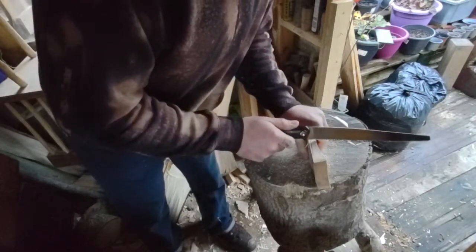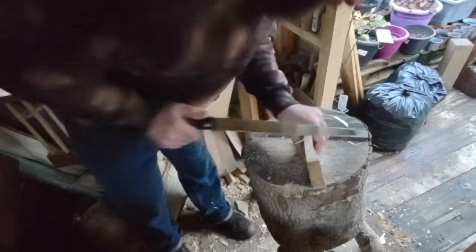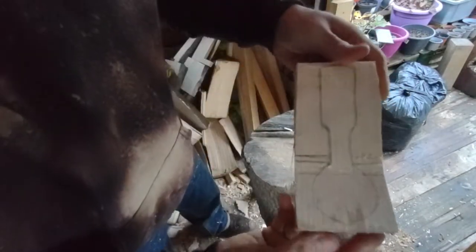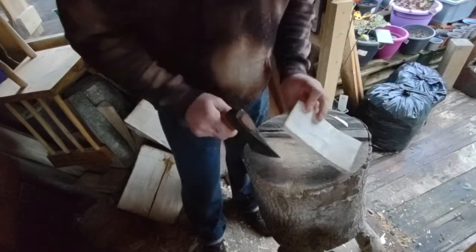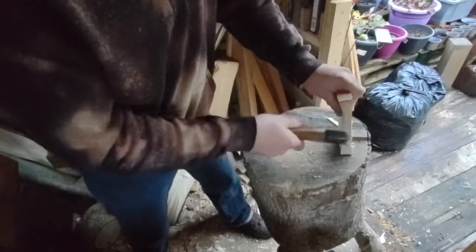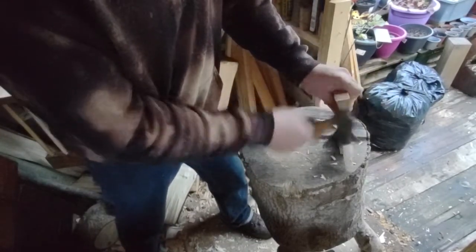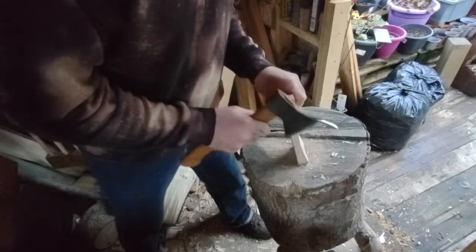Because you're going to do the knife work anyway, and the neck of the spoon will end up being narrower than this — I draw them wider than needed in the template, just to give that wiggle room. You can always take some off, you can't put it back on. Stop short of the template line, blow your block off. You could then axe down the material you don't need. Put the billet a nice distance away from you on the block so if you do miss the axe buries into the block. Keep your legs in that half-lunge position.